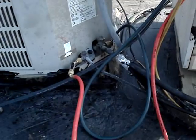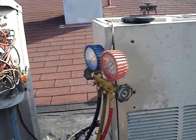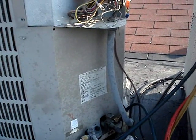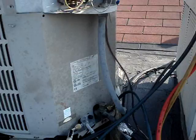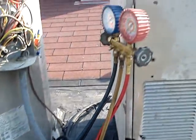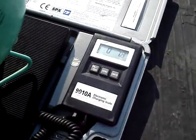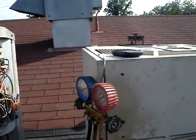Now the vacuum's over. We're weighing in the charge on the unit — it's matched up with a really old Rheem Ruud unit, so we're just going to go by the Goodman specs. You hear the click there — that's a low pressure switch, so we've reached that point at least. We'll go by the Goodman specs and line set and adjust from there. Weighing it in a little bit at a time, we've got seven pounds to get in there.